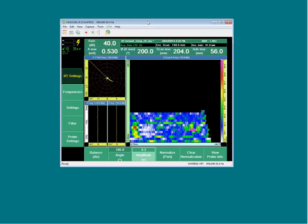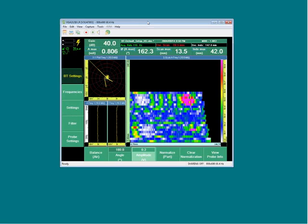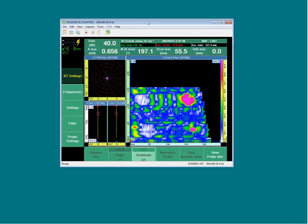About halfway through scanning the standard, a vertical bar appears in the C-scan on the very left — a core splice — and then a set of six different flaws or indications appear in the C-scan view. After a couple more scans, the scan is complete and frozen. The C-scan now shows the full coverage with some interpolation visible, and fine-tuning of the display for each frequency can begin.